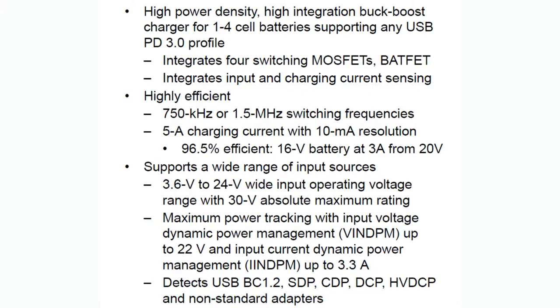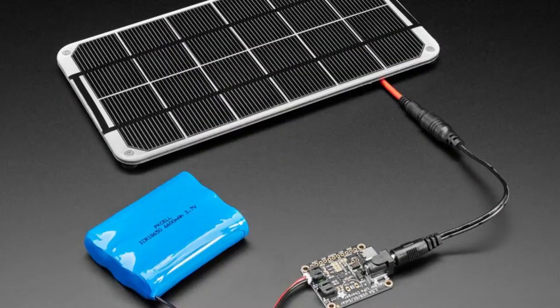It has D-plus and D-minus lines to detect USB chargers — like the Apple resistor charger divider thing, where the voltage on the D-plus and D-minus pins when not connected to a host can tell you what the charger is capable of. I recently started using BQ charger chips — this is our solar LiPo charger, USB, DC, or solar, using a BQ chip. Not this one — I think this one's a linear charger — but it works great. I really love these BQ chips. TI has been making LiPo and other battery charger chips for a very long time, and recently they've really stepped up their power supply and battery game.